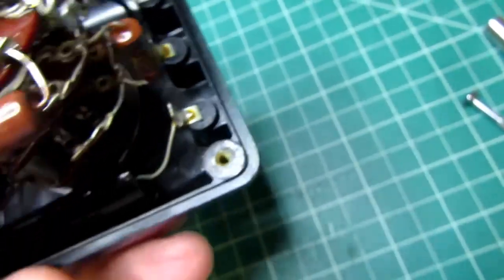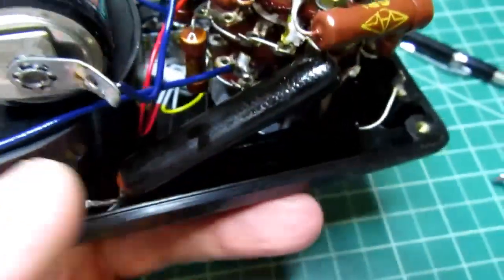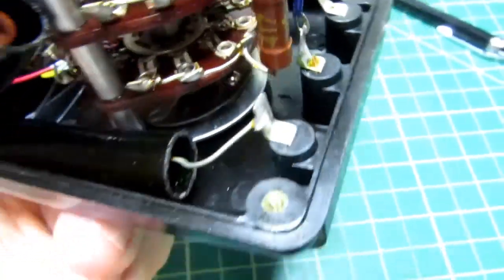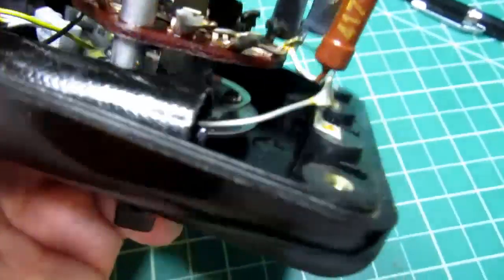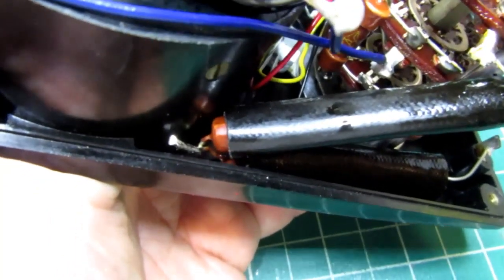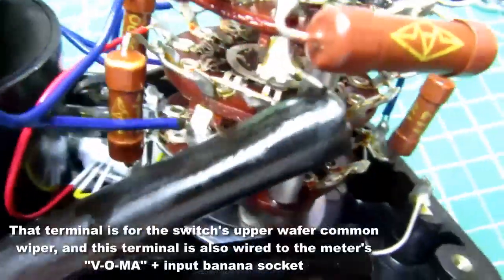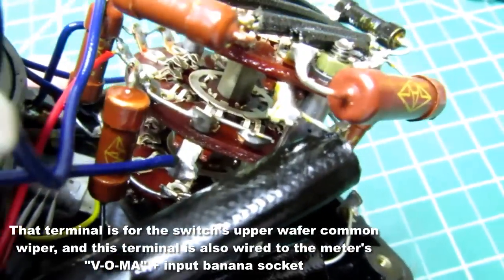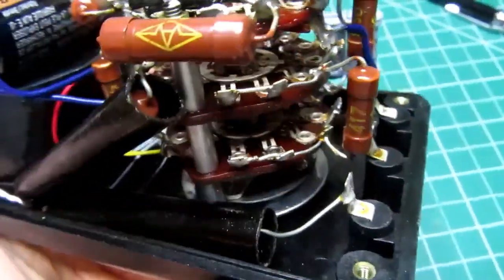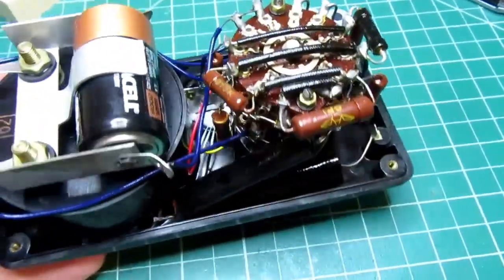The trim pot is held by a little metal bracket — almost like a speed nut that slips over a molded protuberance on the Bakelite — which holds the aluminum bracket onto which the ohms-adjust potentiometer is mounted. The other two resistors on here are large ones inside insulating heat-resistant tubes, likely asbestos or something similar. These come from the 5000-volt range — one resistor goes through and where they're joined in series it bends around and goes to the terminal on the switch, picking up the normal resistor attenuators.